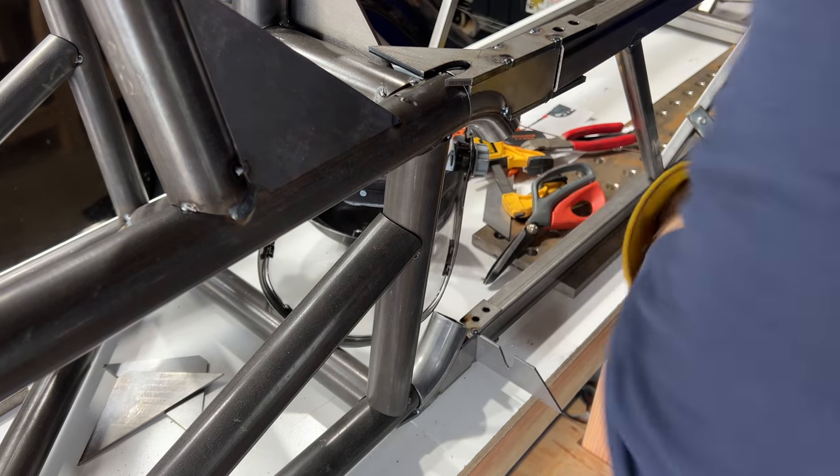To get the air out the back of the frame, I designed a junction from the rectangular tube to the bent round tube. Normally this would be difficult to make, but I have the power of lasers — laser-cut metal from my friends at SendCutSend. I drew up four plates, each with the correct curved cutout, and then welded them together with the bent tubes in place. I added some little tabs so it would all jig itself together. I designed this so the car can be separated right here — this is a bolted joint. I did this mostly because the car is 20 feet long, and there will likely be a scenario where my life will be easier if I have two 10-foot-long half cars. It might just be getting the car to the salt flats or getting it off this workbench, but in any case, this is where it becomes two.